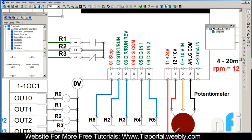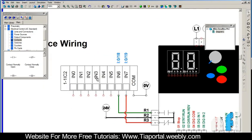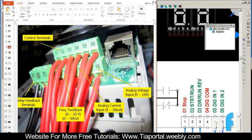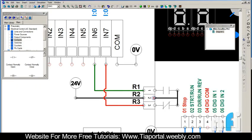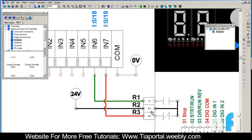Let's look at the PLC input card. We have connected some PLC input terminals to the relay feedback terminals. There are three relay terminals R1, R2, and R3 on the drive - the PLC has an inbuilt relay, similar to an Omron relay with three terminals: Common, NO, and NC. The middle one R2 is Common. R1 is NO, R3 is NC. This common goes via R3 (NC) to my PLC terminal I:0/19 - that's the last PLC input, connected to the NC of this drive relay.